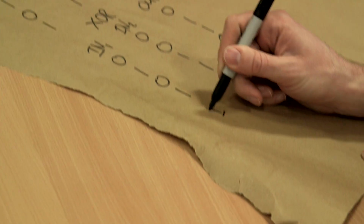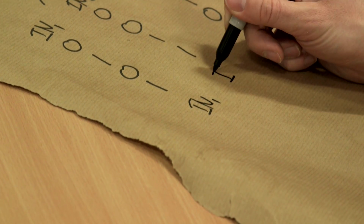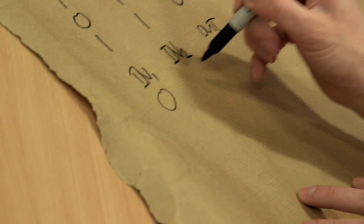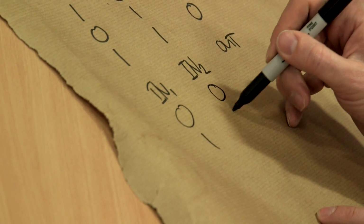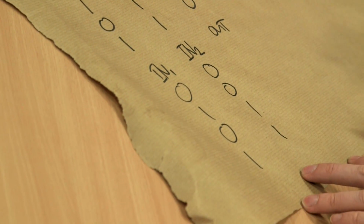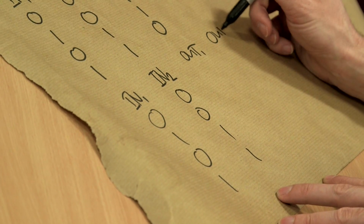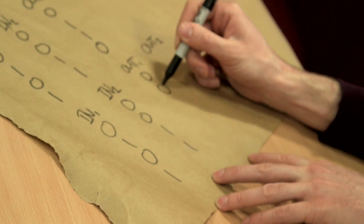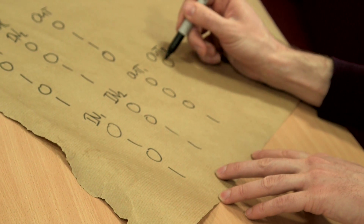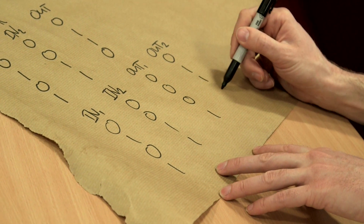We're going to have input 1 again. We're going to have input 2. Then over here we have the output. Now, again, these are our standard options that we have every time. They're all 4 ways you can bump over 2 inputs. Now I'm going to have output 1 and output 2. Output 1 is going to act as if it was an AND gate. So we'll have that happening. Output 2 is going to act as if it is an exclusive OR gate.